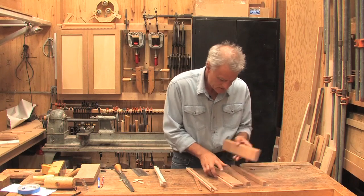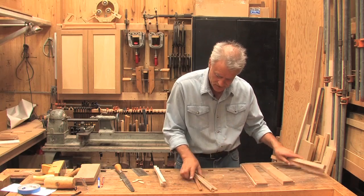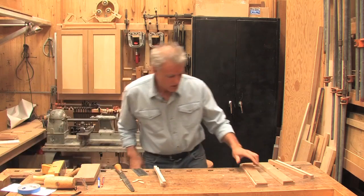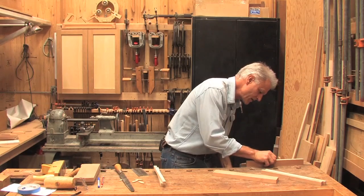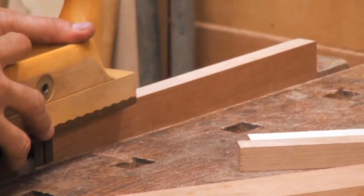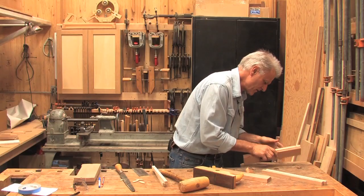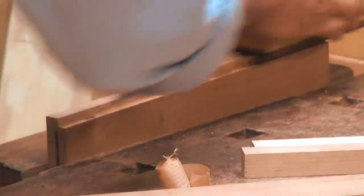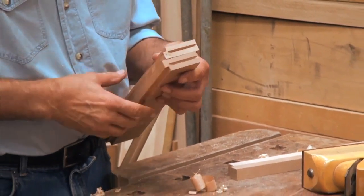Okay, so these are the parts that came off the table saw. I have my 2 lid pieces here, all the 4 strips, which I'll set aside for later. And now I can clean up some of the burn marks and start sanding this piece in preparation for glue up. Okay, get the other side. Make sure the grain is going the right direction. As you can see, the biscuit is very close to the ends, but it doesn't protrude past the ends. That's why I use number 0.